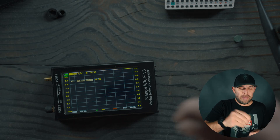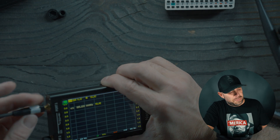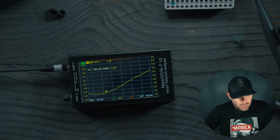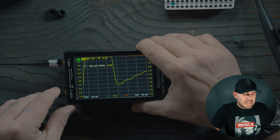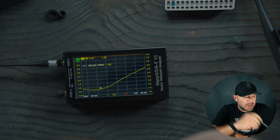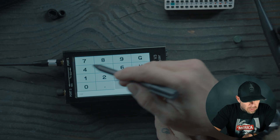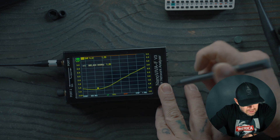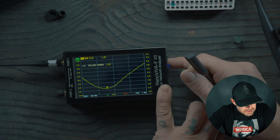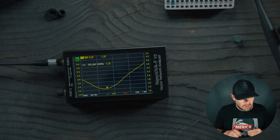Next, we're going to look at this little whip from Amazon — I'll put a link in the description, some may be affiliate links. This is the 915 one. This gives us a really weird-looking graph. That's not to say it's a bad antenna for MeshTastic — if you go back and watch my video on mesh analog nodes, I actually used this antenna and it performed really, really well. Just take some of this with a grain of salt. Expanding the range to 800 megahertz to 1 GHz, this antenna's sweet spot appears to be around 876 megahertz at about a 1.3 SWR.